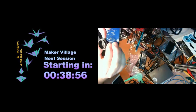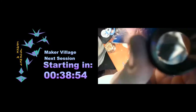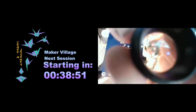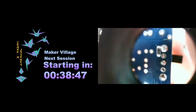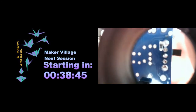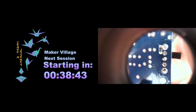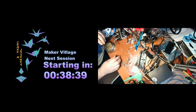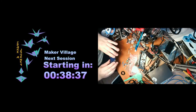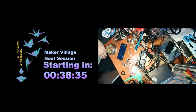Kind of difficult to do with the camera. Sorry, guys. But what we're looking for, as you can kind of see, the pull of solder is a little closer to that resistor than we want. So we might use our desoldering wick and take some of that away so that we don't risk having a problem.